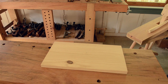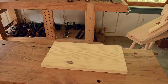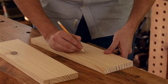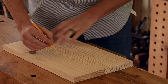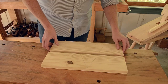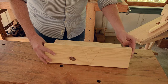Whether you're using a hand plane or a power router, make sure you have perfectly squared boards and make sure they're longer than your final length so you can cut off any plane tear out or router snipe. Orient your boards to cut with the grain as much as possible. Use your piece of wood with the most favorable grain for the tongue since the shoulders will be visible after the cut. Place the tongue board on the left and the groove board on the right and make a note of which board is which. The board with the less desirable grain can be used for the groove since most tear out will be hidden in the center of the joint anyway.